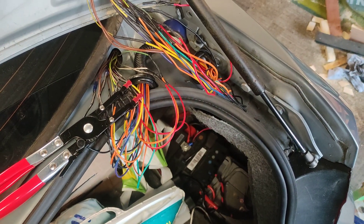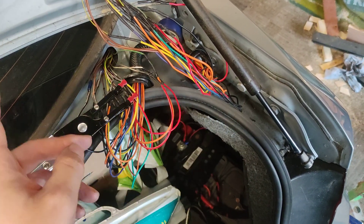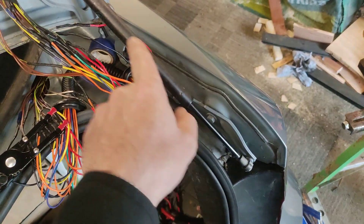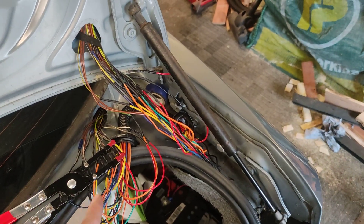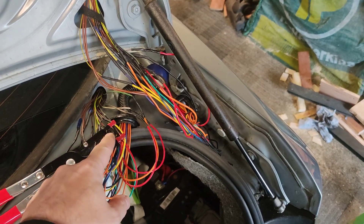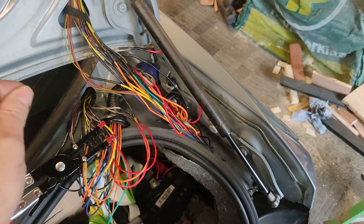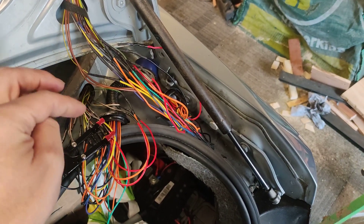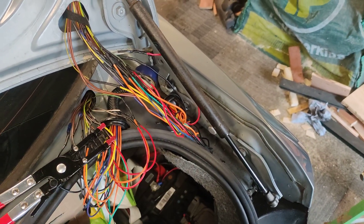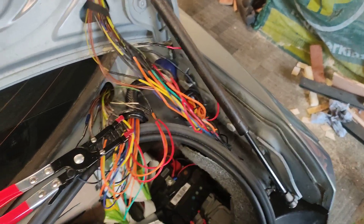What I was doing is stripping the wires — four pieces stripped for one wire connection. When you've got the wires aligned, squirt a bit of flux on there, then use your soldering iron to melt it slightly so it sinks into the wires. Then apply your solder, move your heat shrink over, do the second joint, then get your heat gun and shrink them both. Then move on to the next one.